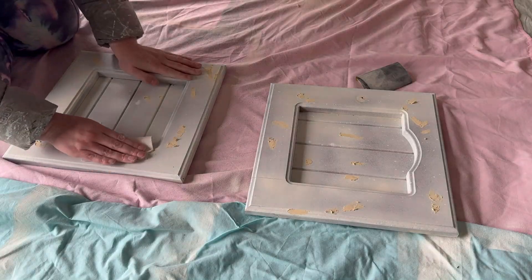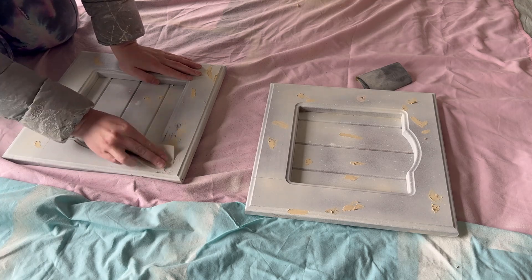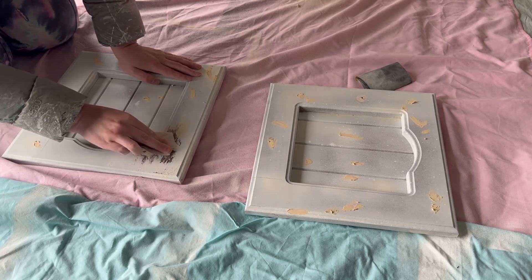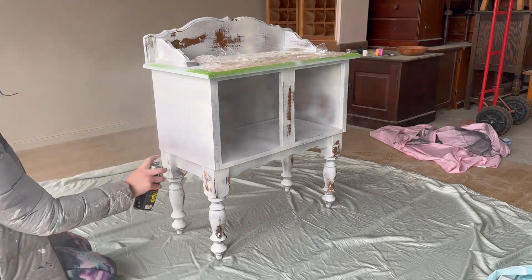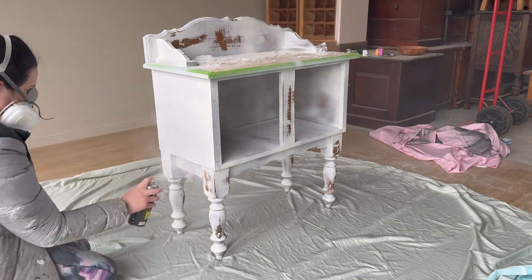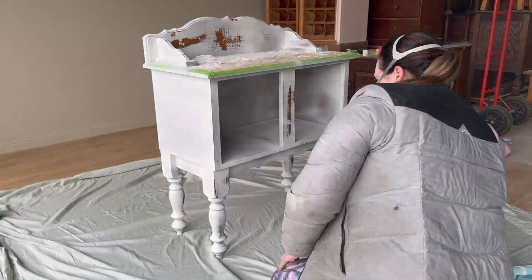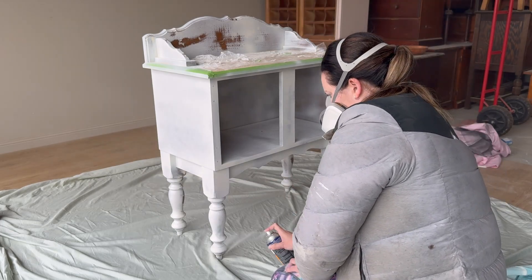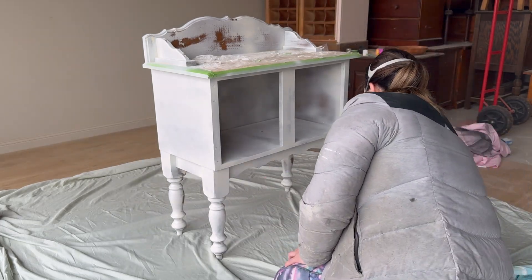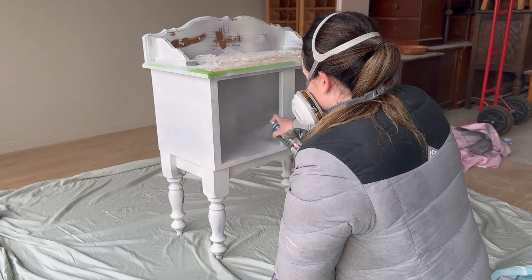You'll see here that I am using just a piece of hand sandpaper to sand off the excess wood filler. However, I actually sanded off a lot of the primer. This showed me that the primer didn't stick as well as I wanted it to. So I did another scuff sand of the entire piece and then I applied another coat of primer — an oil-based primer — just to put a second coat on to make sure it was ready for paint.